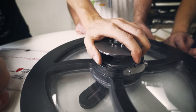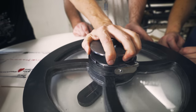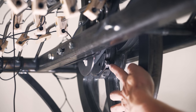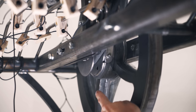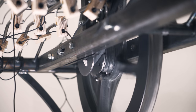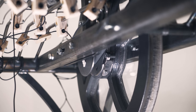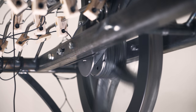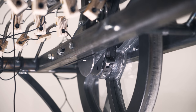So then I'm going to start to drive the flywheel. So this is the acceleration and then that's the safety function. Right there is the little ratchet powered by a spring steel and it grabs hold of those teeth here. So I'm gonna try to unlock it when we can see the ratchet. There, did you see the ratchet slip? And then the other way, it catches the teeth. And now you see it hasn't locked. So when I move forward, you can hear the click when it's locking again. There.